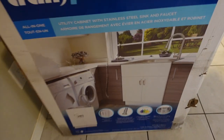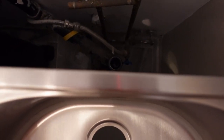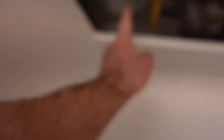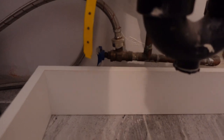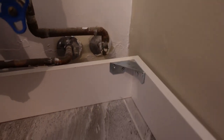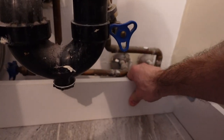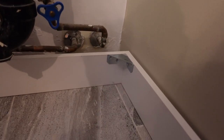This is the laundry sink I ended up getting. This is just a dry fit and overall this installation goes very poorly but it does get done. Right away you can see I'm going to have some issues sliding this in based on where all the plumbing is. I am going to have to do some cutting on this cabinet — even the base is too high. The copper plumbing is at about three and a half inches whereas the base is four inches, so I am going to cut the base down by about an inch and a half.